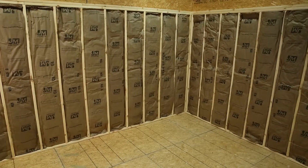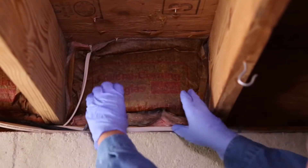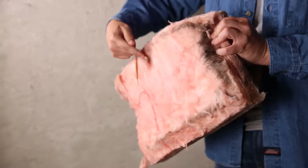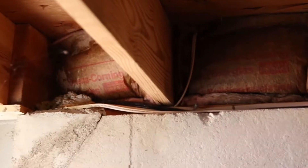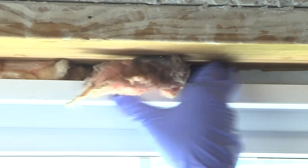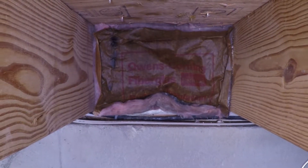Inside wall stud cavities, many homes only use fiberglass or mineral wool batt insulation. Let's pull one of these out and take a look. You might just think the dark areas indicate that it's simply old insulation — this is actually dirt, pollen, and dust coming from outside the house. The fiberglass batting is acting as an air filter for outside air entering the home, just like your air conditioner filter. All that unconditioned air flows right through the insulation and into the house, causing temperatures to go up in the summer and down in the winter.